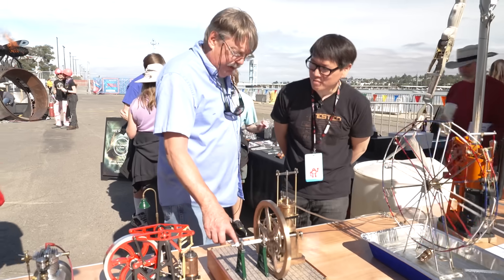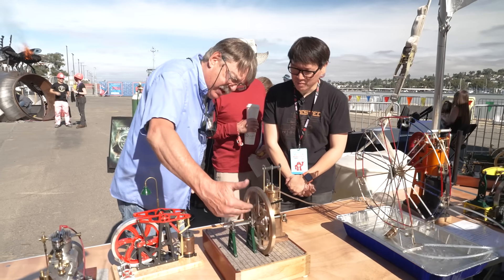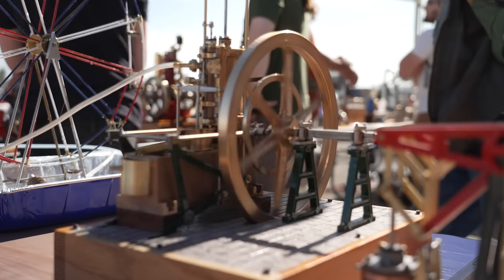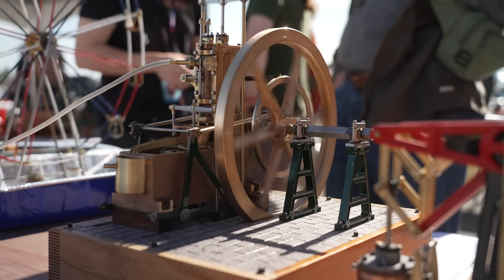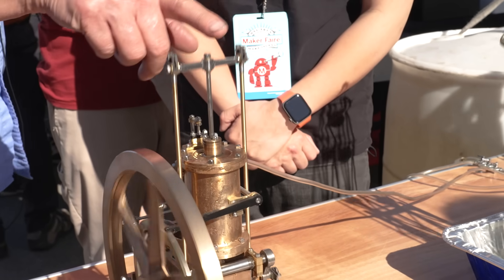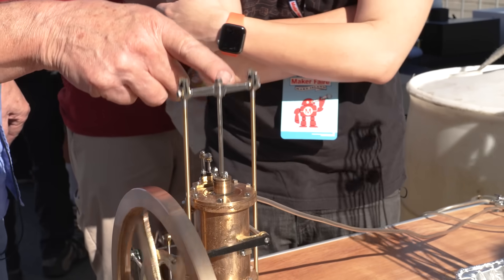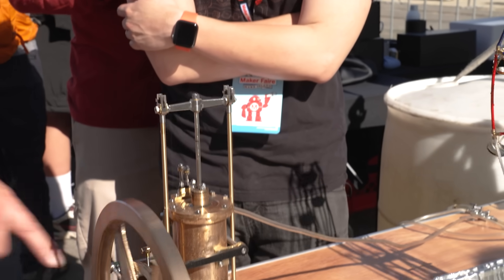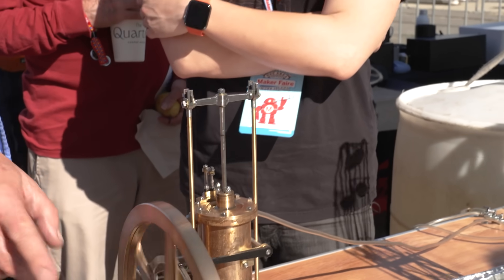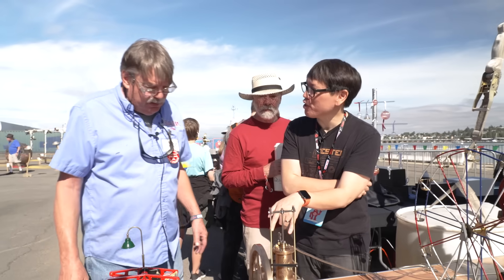This is called a Wyvern — it's a four cycle, hit and miss. It wasn't originally made hit and miss, but I added the hit and miss mechanism to it because I like hit and miss. This one is very, very old — 1802 is really the beginning of steam, and a lot of this stuff they really hadn't figured out yet. Like this valve mechanism with this big hoop on the side, comes over to a shaft here, operates this. Most steam engines have a thing called a D valve, but this is not a normal D valve. The steam does not help it seal at all, but it's true to the original 1802. These are called cotters and wedges — that's how they hold bearings in place. Back then they didn't have hex head bolts — they're all square. Most metal they had was forged, and they started with the square and only made enough round that they needed. You're making the bolts here? Yeah — 90 of them.